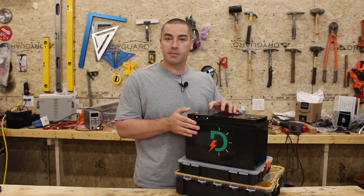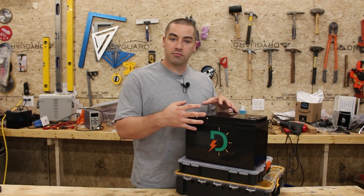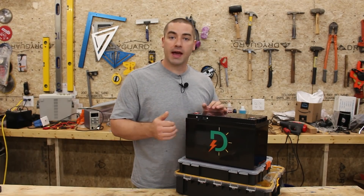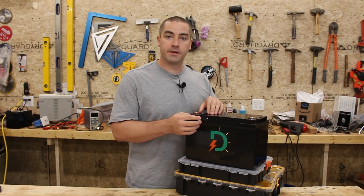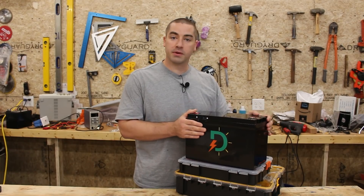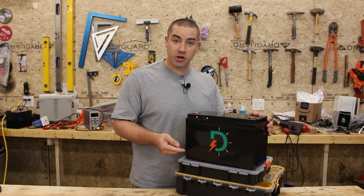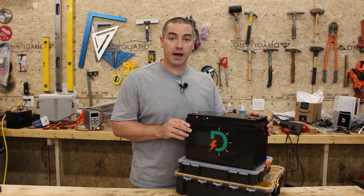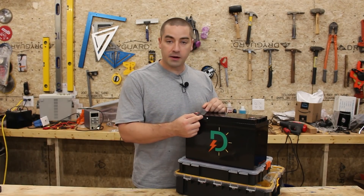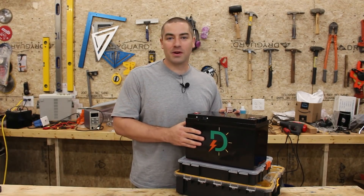I care a lot about extending the life cycles of the battery and I want to make sure that I'm not stressing the battery cells hard. The batteries can get warm if you charge them at a high rate, so I limit it to 50 amps primarily for charging. Now if your application requires high amp discharge and you know you're going to have a low amp charge, you can beef up the nickel contacts, add a bigger circuit breaker and a bigger BMS. It's your build — you get to do it any way you want.